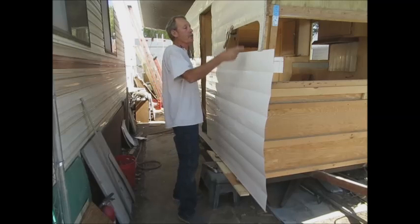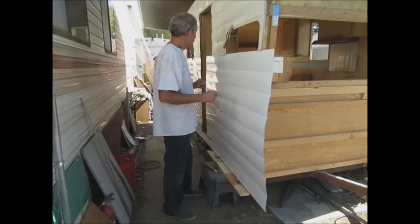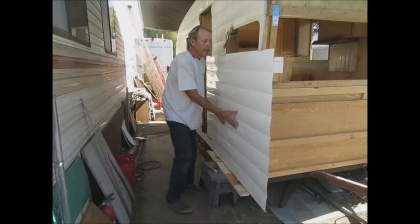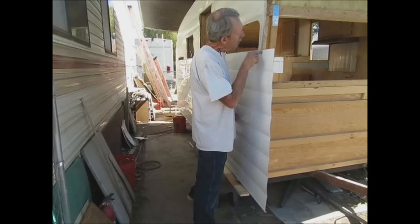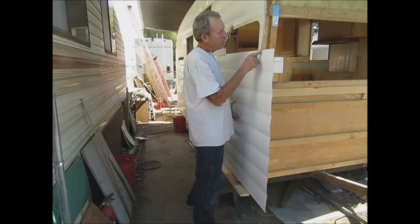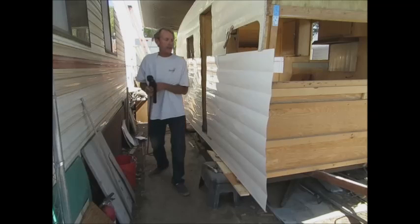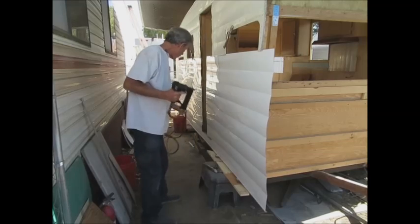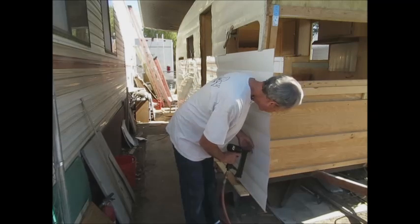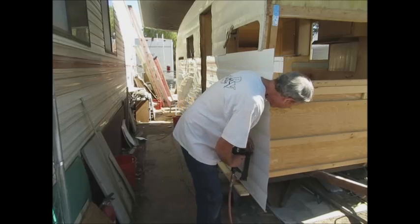If you have a Shasta, go to the Shasta series to see how to cut this out. This can't be bulging out because if it does, it drops this down — you want everything nice and tight. I'm going to put a staple right here at the very end where the curbing is. Make sure your curbing is on before you do this; it's going to get covered up with J-rail. I'm using three-quarter-long staples, quarter-inch crowns, with my Central Pneumatic staple gun. Always staple in the brake — don't staple in the middle of the panel or you'll have a dent.